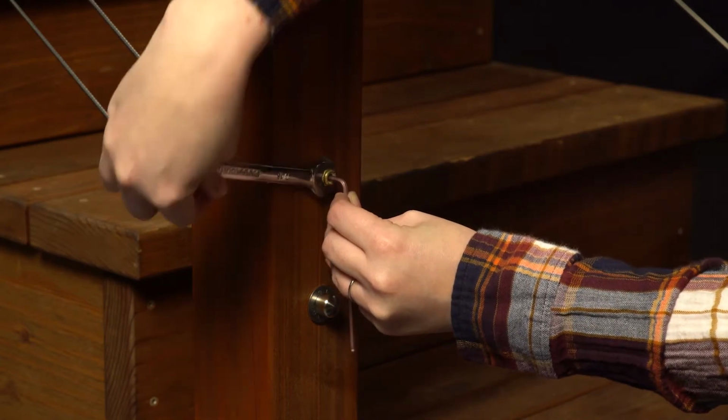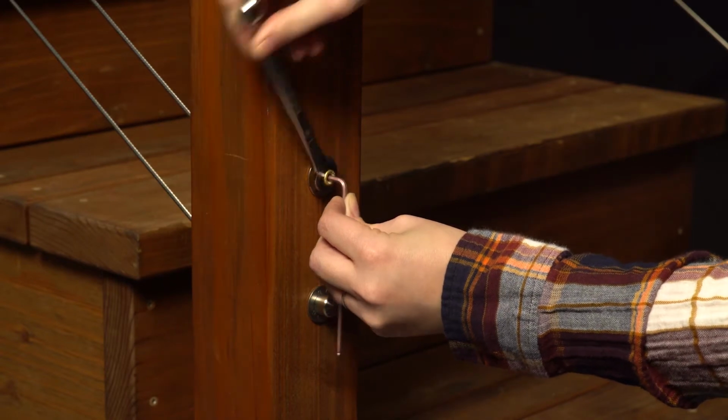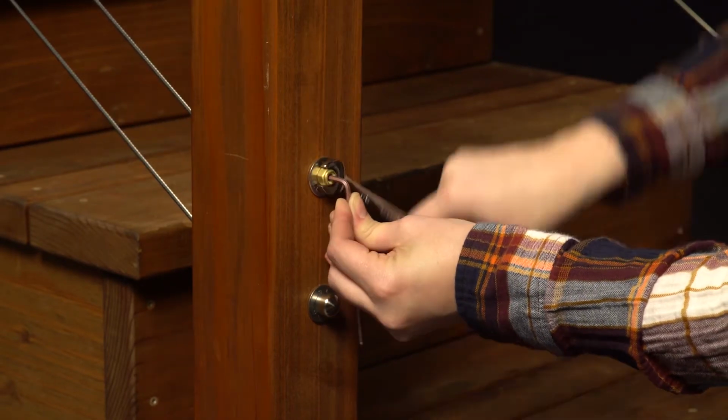Tension cables. Return to the threaded stud end post. Insert an 1/8 inch hex wrench into broached opening on the tip of the stud. Tighten the lock nut with a 7/16 inch wrench while holding the hex wrench to prevent the stud from turning.